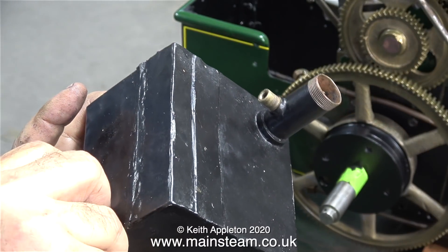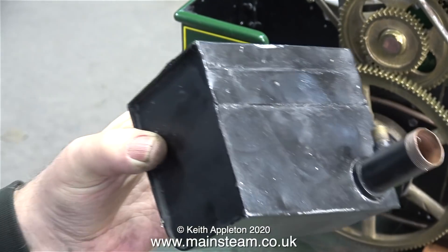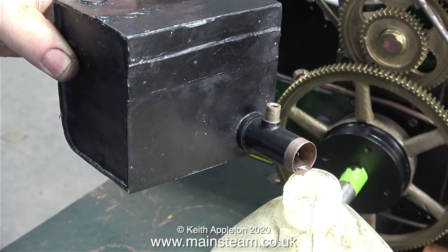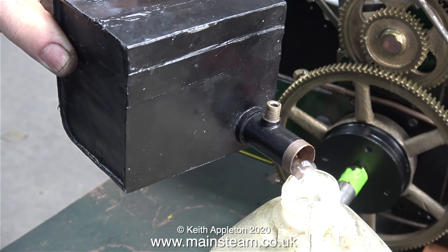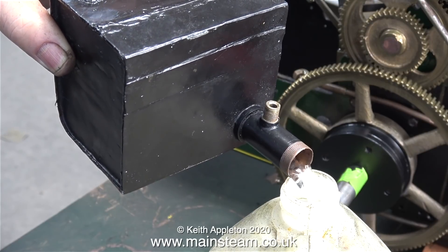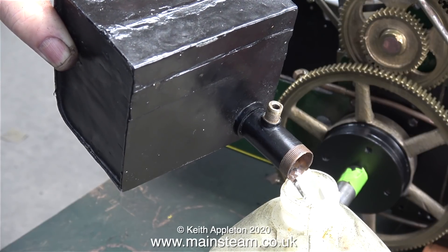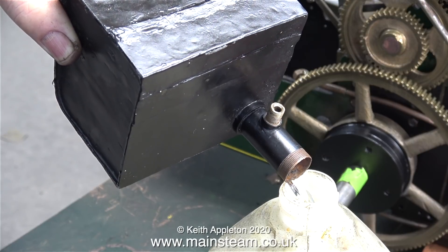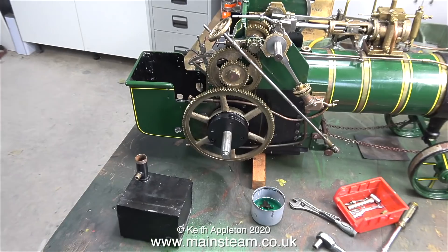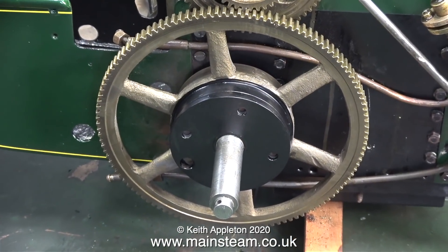When the owner delivered the traction engine he did say that the tank in the bunker leaked, so I filled it with water and it doesn't appear to leak - I don't know what's going on. Maybe the culprit is the tap on the top, the bypass valve. When that's shut it could be leaking, just like on my traction engine - the water bypass valve from the pump is a taper plug cock, and these are prone to leaking. I'll see what happens when I put it all back together. The pump still needs some attention anyway, because that leaks.